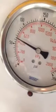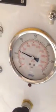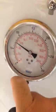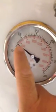and we close the valve. Okay, so now, very simply, our switch is shutting off at 80 psi. And again, we have a backflow built into this system so that you can see how the pump comes on. As the flow starts, the pressure goes down, it kicks in, builds up pressure to 80, and that's where it shuts off. In your system, as here, if there's no flow, the switch will shut it off at 80 and it'll be set.